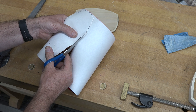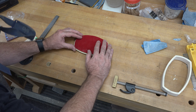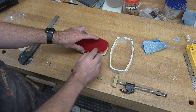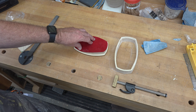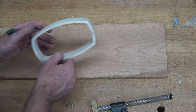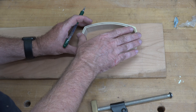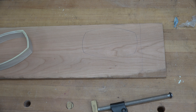We're going to cut it out. There are lots of different ways you could cut this — you can use an exacto knife, a Cricut cutter if you have one, or for my purposes today I'm just using plain old scissors. We'll check our fit — if it's a little small it's not a big deal because we can trim it, and the edges of our rabbet will hide slight imperfections. I'm going to spray it with spray adhesive, place it immediately down on our board, clamp it down, rub it as best I can, and let it set up.